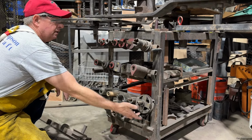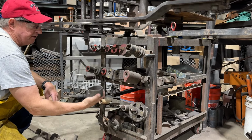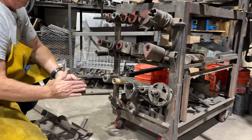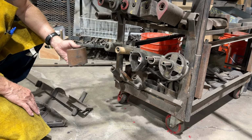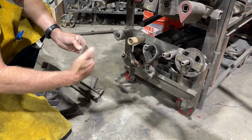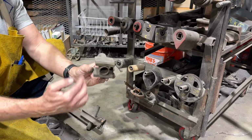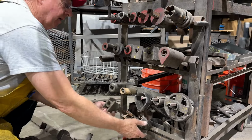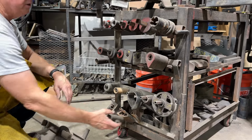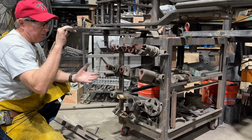I've got a specific die here for rolling tubing. This is a shape for some project. I can't even remember what it was. These are fairly useful in that sometimes you have to work with a really large radius and you don't want to mark up the part. So this is just a very gradual bend here. I think this was even flatter. There's a little tiny bit of radius here. And then I think this was to hold a piece of tubing, so I have the 2 pieces of flat bar. But anyways, the whole central point is that you can have relatively simple tooling that you either buy or make,